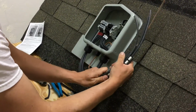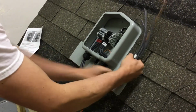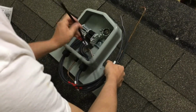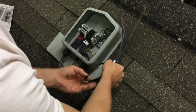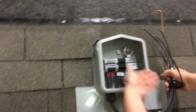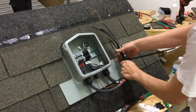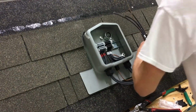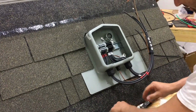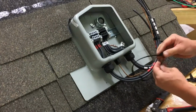And your copper wire is landed on the grounding lug on the adjacent rail. Correct. Now when you put your zip ties on, you want your zip ties to go all the same direction and facing down. So I always get in the habit of feeding the zip tie through this way and also through the rail. So when you pull them down, you've got them right there. Pulling down snug. And we're also going to get another zip tie here. So this one's going to go down, always down or to the side.